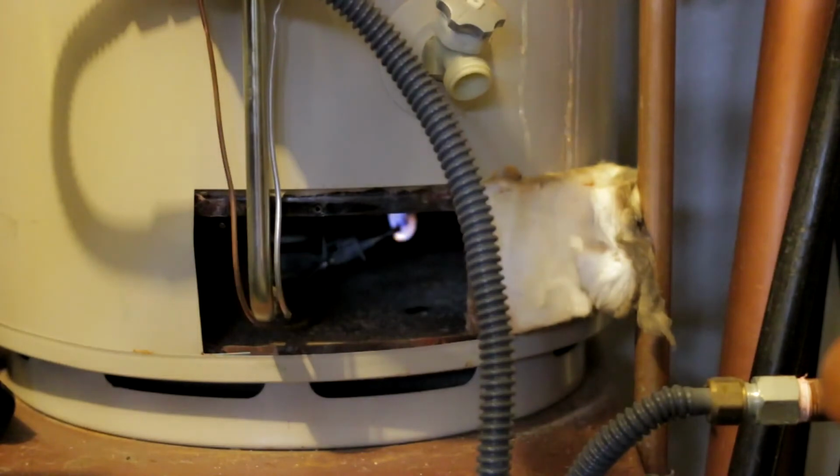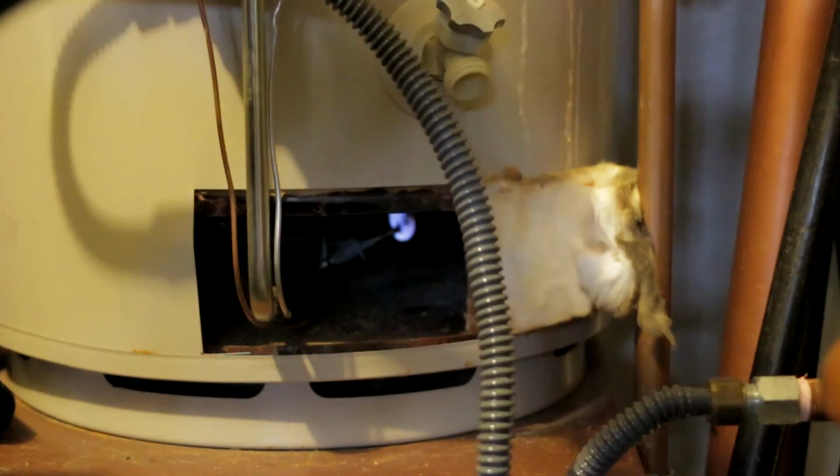And now, I don't know if you can see in there, I've got my pilot light lit. And I'm still holding down. You need to hold down for about 30 seconds to make sure it stays on. So I'm still depressing that pilot light knob up at the top, the black one, holding it down in the pilot position. That should be enough.